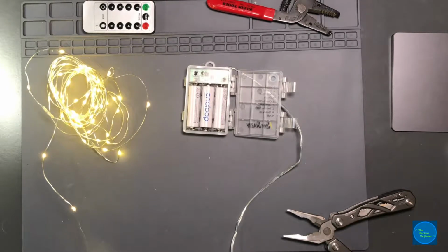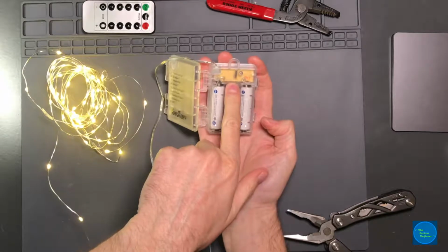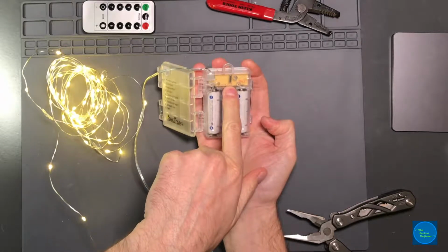And what he was describing was the clock drift that occurs on these RC oscillators as opposed to a crystal over just a couple of days. And so I'll link to his video here to take a look at that if you're curious about what that is. But what I found on these is that if you flip it over on the back, there's a crystal oscillator right there on the back.